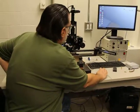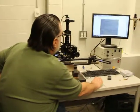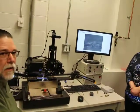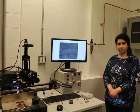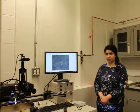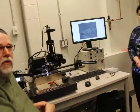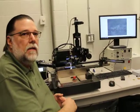Some recommendations, good starting points and tips depending on the bonding that you use. I asked a question about conductive glue. So you just need to apply the pressure, right? Right, that does not require any heat. Well, there might be a low level of heat, maybe for a cure. All these products have data sheets with recommended processes for you. They'll tell you how long you should be at a certain temperature and that kind of thing.